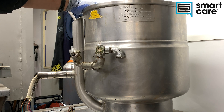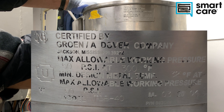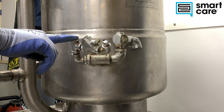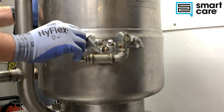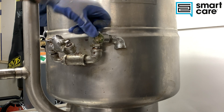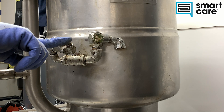The first thing to note is on our data plate — this is a pressure vessel. It heats up, it builds pressure, so it has ratings to be a pressure vessel and it's been certified. Knowing that it's a pressure vessel, there are a couple things we have to have on it. One of them is missing: there should be a pressure gauge here but it's been removed. Down inside is some iron debris, and then we have a safety relief valve — this relief valve has broken, but it should have a pull ring so that you can bleed the kettle off. This also has a check valve and a pipe fitting added so that you could add water to the steam jacket.